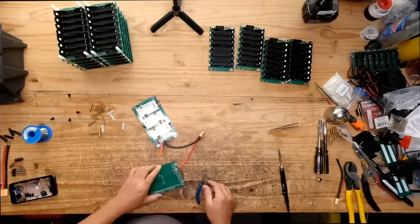And then that battery is going to become a product eventually in our cart, and it's probably going to be the 24 volt. I mean, I don't know. I already built the 48, so maybe I'll offer it at 48 volt too. But to make it a 48, you just get two 24 volts and put them in series outside. And then you have that also, right?